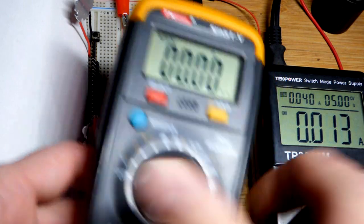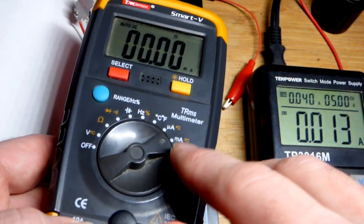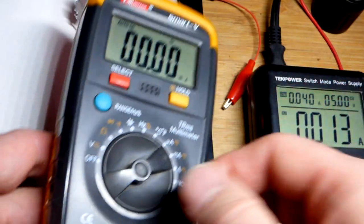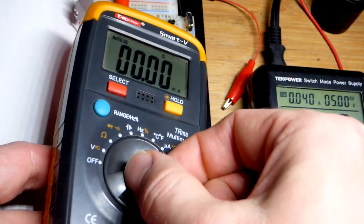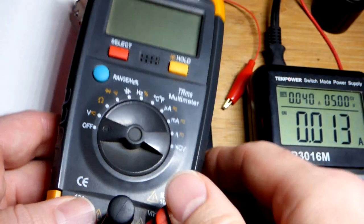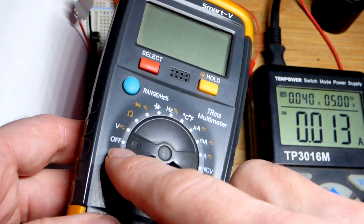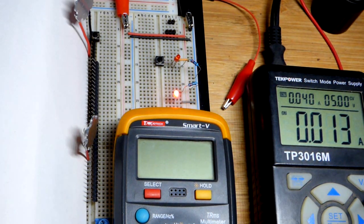Now, as I said before, putting too much current through the meter will probably blow a fuse, and may damage the meter. So you don't want to accidentally measure too much. So if I try to measure a voltage directly, there's not going to be limited current, especially for a battery. This I automatically limit just to make sure I don't accidentally fry stuff if I do a short circuit. But in any case, definitely get the meter off of measuring current, and if there's an off setting there, set it to off. Otherwise, hit the off button. It's that simple, not too bad.